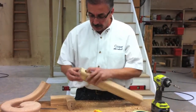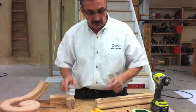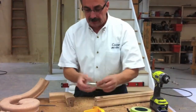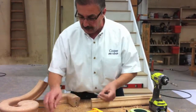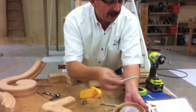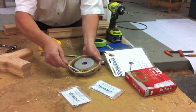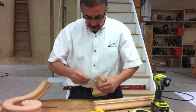Okay, so now you've got the 1-inch hole, the 3/8 clearance, the 1/4 inch pilot hole for the lag end of your Zipbolt. And I want to show you how easy it is. You're all set to go once I put this in. 7mm hex on the shaft, as I had mentioned earlier. And here's another little tip and technique. This is what you seal a toilet with. A little bit of wax helps. If you put that on the end of the bolt, it helps it go in easier into your fitting.